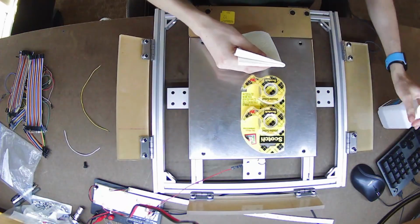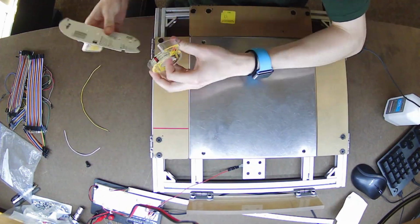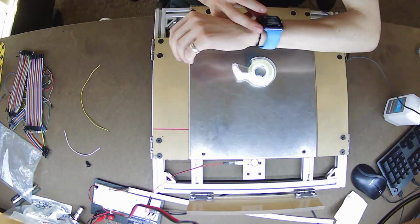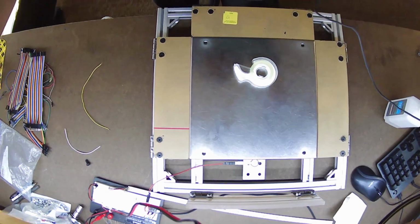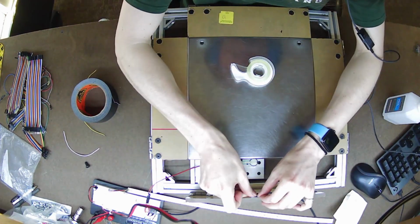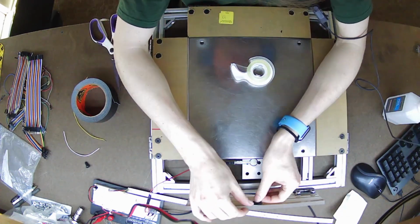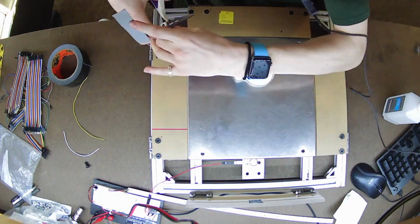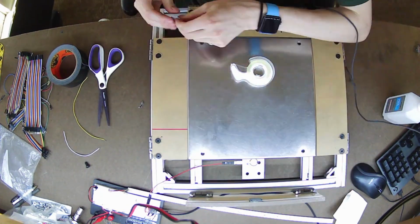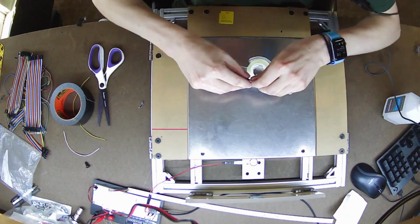I use standard Scotch double-sided tape. Made sure to clean off the brackets real good with alcohol first, just to make sure there wasn't any grime stuck between the tape and the FSR. Then, after getting the FSR taped in place, I used Gorilla tape, which is my go-to tape for pad modding. Stacked it up on the underside of the panel until I got the height approximately correct to rest on the FSR and approximately level with the top of the center panel.